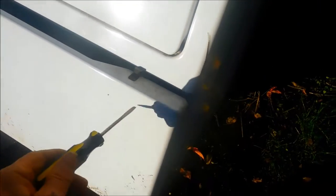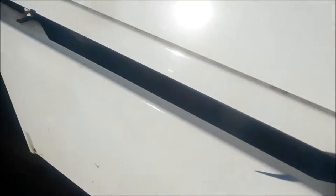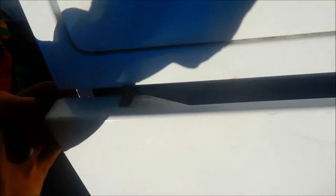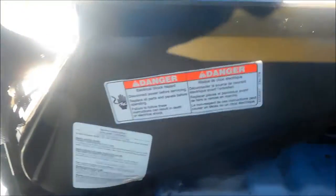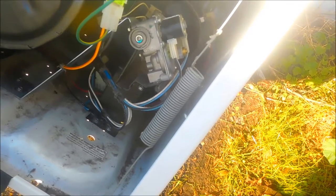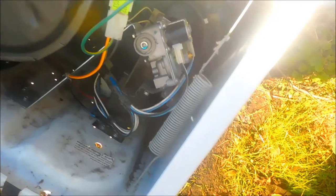This style dryer here has got the clips on each side of the bottom. You'll need to push down on those tangs in order to pull this out. Basically, you push down on the tangs and at the same time pull out, and you'll be able to open up the inside. This particular burner unit is over here. It's a little tricky to get in there and pull that without pulling everything out, but you can remove that jet and the diaphragm top screw without taking everything apart.